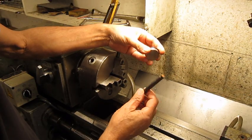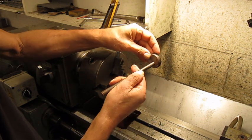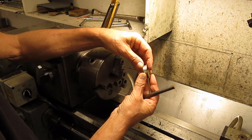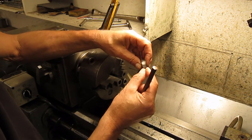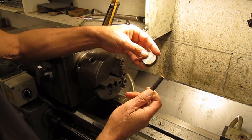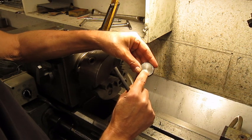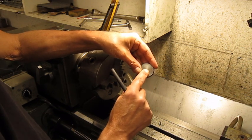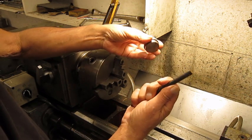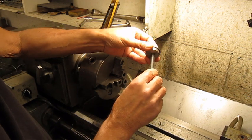Next will be to make the piston and a piston rod that's going to fit up here. I found myself a smaller piece — I think this one will be better, and if it doesn't work I can always take it off. The idea is to drill and tap M8, turn this one down to 8mm, tap M8 as well, and then screw it in.